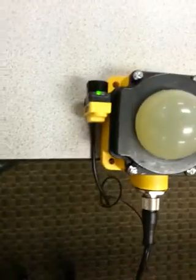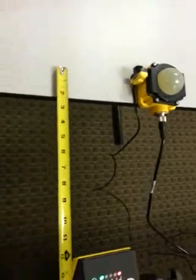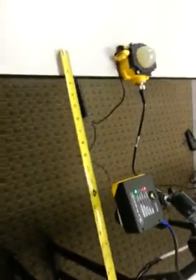I've got a gate photo eye, and it's mounted to my light. The light will go green when we have a good read. It will go red if we get a no read. These codes are interleaved 2 of 5, 14 characters. I've used this little box for some wiring.